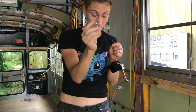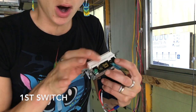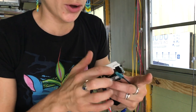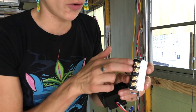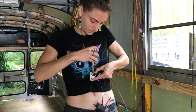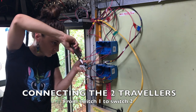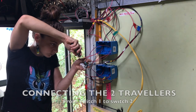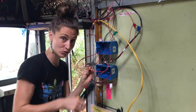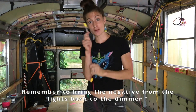I'm gonna give it a little hook. Here it's all common — this is gonna be for our kitchen, here it's gonna be for our living room. The power goes from here along the two travelers to the other switch. Then I connect my travelers, get the red wire attached to the common, and distribute the power to the light. From the common of the second switch, I attach my light.